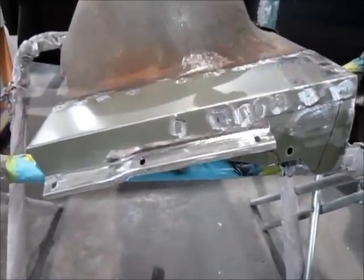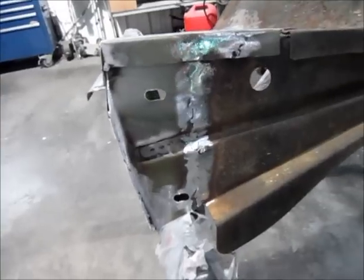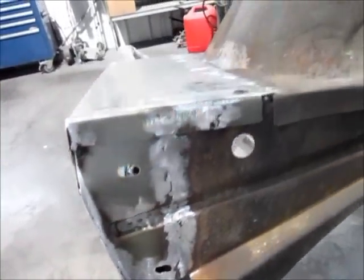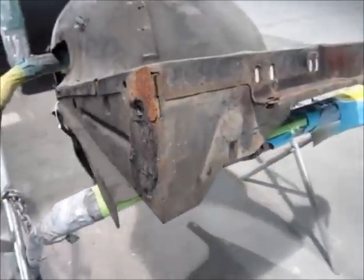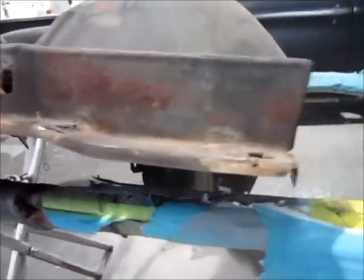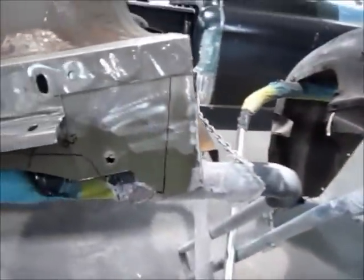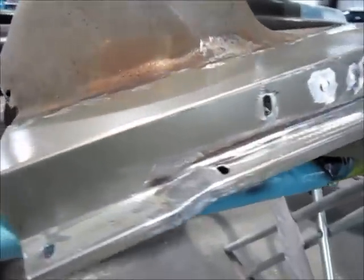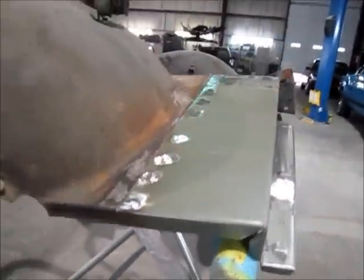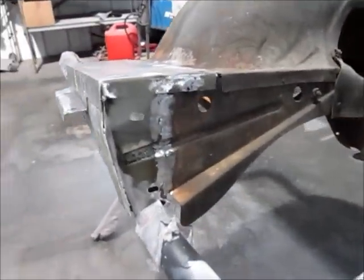There's the finished product. It wasn't much to work with, but having this other inner fender helped a lot. I even made this recess the way that it was, and all the holes are where they should be. Here's the other one — there's some sort of tar or sealer in there — and looking at it you can see there's that joggle. I'm pretty happy with the results. You can see my lines where I drew stuff on it, but there's that joggle. I did test fit it to the car and it fits very well. Once it gets sandblasted and gets some primer and paint on it, I think it'll look pretty darn good — hard to tell that it wasn't made this way.